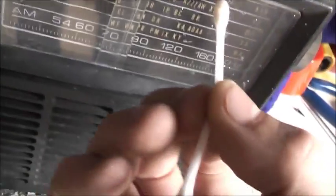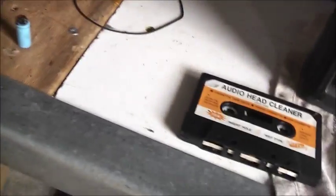99.5 - working well. I've cleaned up this mechanism as best I can. I'm going to Q-tip over it, which is looking good now. Perfect - that's very clean now. That was filthy. I'm not going to run a tape past that - that'll just do more damage than good. That's how I get a cassette and play some stuff over it.